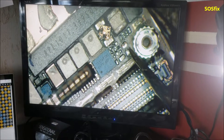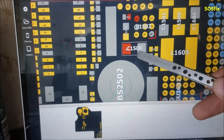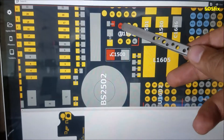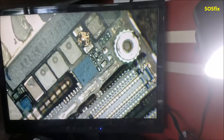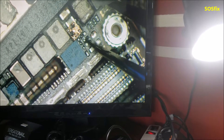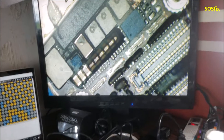I removed the capacitor but the short to ground was still there. So I jumped to this chip because if you look here in the board view, you can see this capacitor is connected to the chip at pad C3. You can look at how the chip and the traces look — there's corrosion, it looks bad.